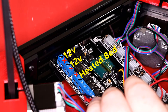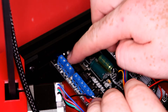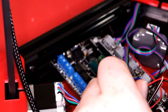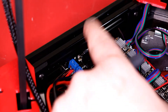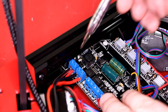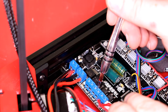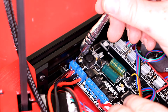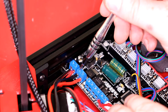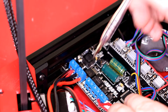We're going to start wiring our board — I left a diagram here showing how it will be wired. These two are going to be your 12 volt inputs, and this is how it should look once wired. Just be aware that you have your negative on top and positive on bottom on these connections, and your hotbed is the opposite — positive on top and negative on bottom. Don't make any mistakes wiring it wrong.